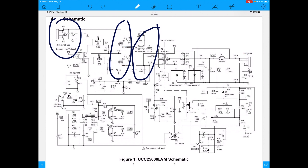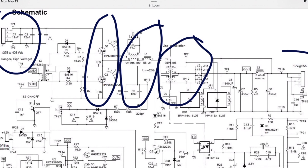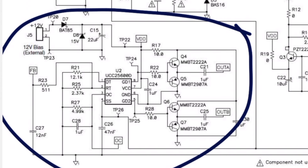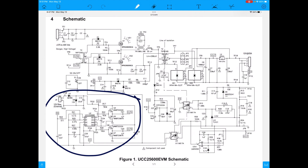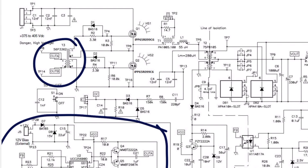These FETs convert DC voltage to AC - what makes it soft switching or resonant is this LC filter. Essentially a sine wave comes through to this transformer, and on the other side it's stepped down to 12 volts. The LC filter gives our output. That big part down here is the control chip - he's the one telling these transistors to switch on and off through the transformer.